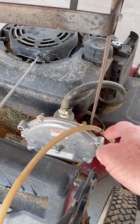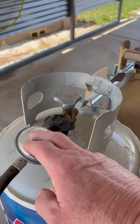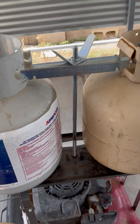I researched it out and what I came up with was this regulator right here — this is a low pressure regulator. Your normal propane regulators put out about nine to ten pounds of pressure; this knocks it down to about three, which is a lot better. Once I added that, it eliminated the hard starting problems — it's just like a miracle almost on this.